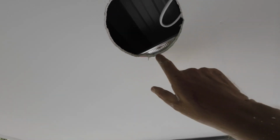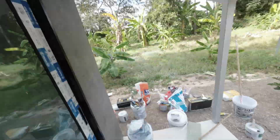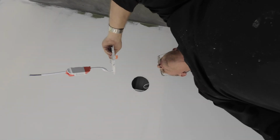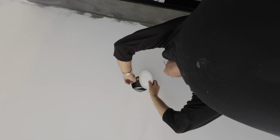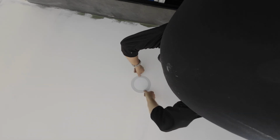Don't worry if you have hit any sea line, whether it's across here or on the edge or anything like that, because with these flush fit lights, I'll just quickly show you. When you wire it up, there's the cable there. Because you've got the sea line here, all you do is spin the clip there, spin the clip there. There you go. Nice and flush. That's nice and neat. So that's how you fit them lights.